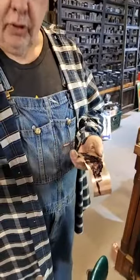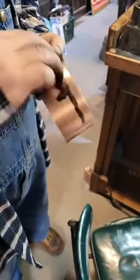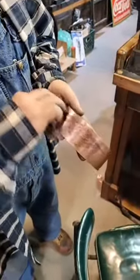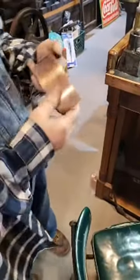Cool. So, when you use your steel wool, you just want to buff the color off. Because what's happened is the ink is now down inside the engraving, just like a print. So we just gently buff it down. Notice it coming out. You don't want to go too hard. Like I said, this is thin crust pizza. This is not deep dish. This is not Chicago style. Those of you who remember my last videos on this subject. Let's look in the light.